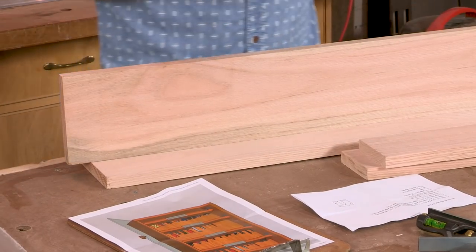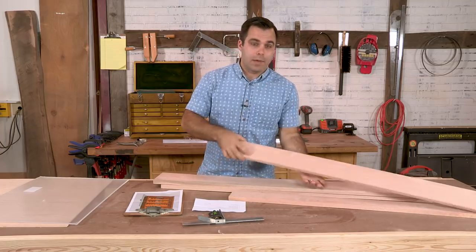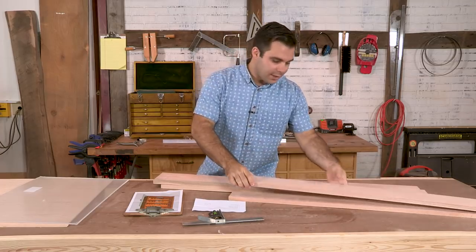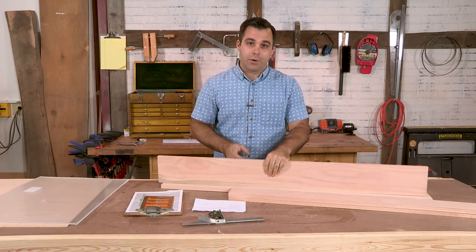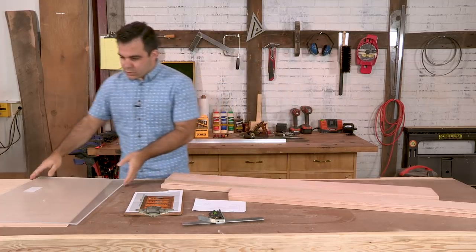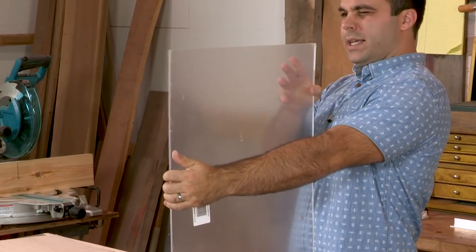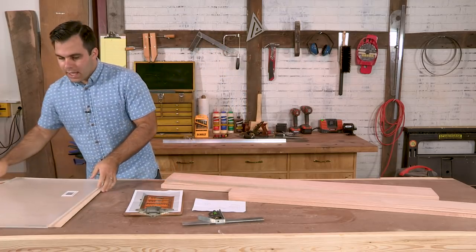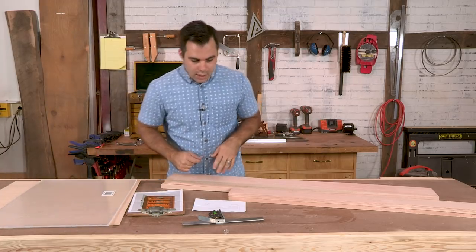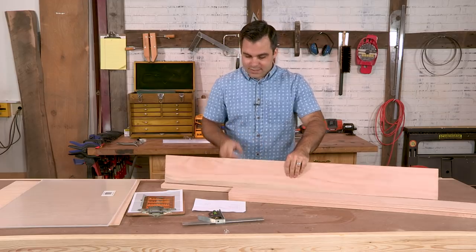The stock we've chosen is one by six red oak — 48 inch pieces bought pre-cut from the big box store — and one by four by 48 inches. Like dimensional lumber, it says one inch but these are actually three quarters thick. We've also chosen to use a plexiglass or acrylic door, 3/16 thick, which we'll need to cut. Our back is made out of plywood.